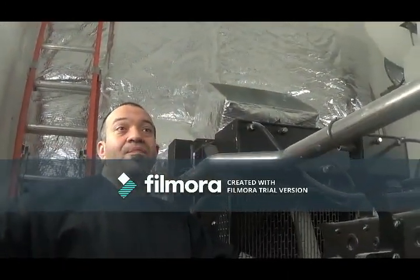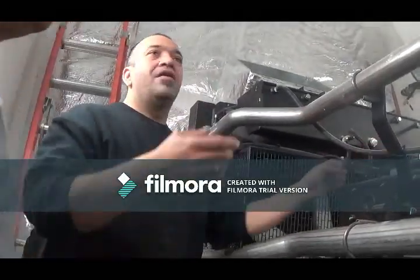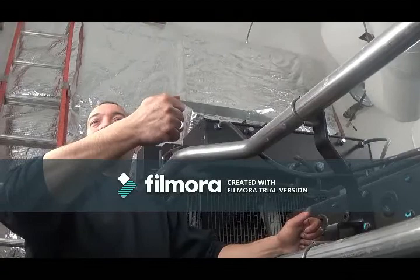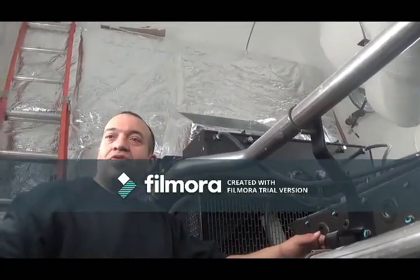If you do top it up, it's 15W40 oil we use, not a regular one. Do you want us to get involved in doing something like this with the machine? It's fairly simple. It's up to you. If you're comfortable, there's a tap right here with a little 1 liter thing, just top it up to where the line is. You don't want to just keep pouring 15 liters in there. Go liter by liter and check a little bit, just like you do with your own car.